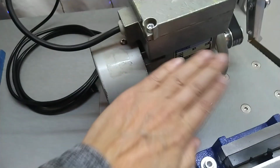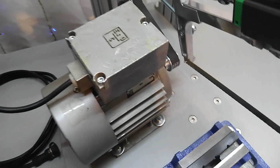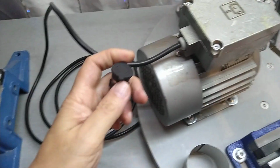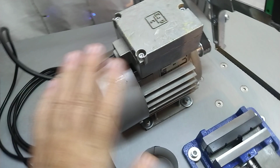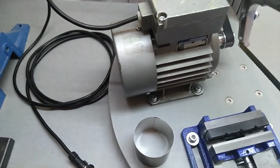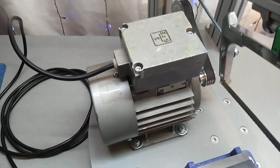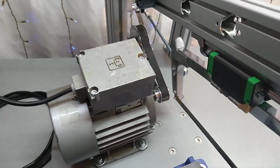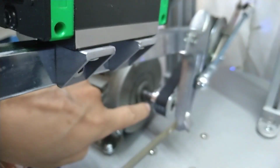At first I did not open it. I connected it to my VFD on my belt grinder, because I'm short one VFD with these nice aviation plugs, and it ran nicely with no noise. And then I opened it up and wanted to clean it or see what's inside, and I took all the old grease out, put it back together, and then it started making a clackering noise.